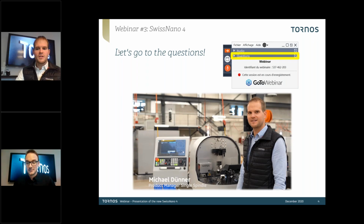Thank you. Last question again. How much time is needed to convert the machine to guide bushless machining? In less than 15 minutes, you can change from bushless mode to guide bush mode or the opposite. We have a parking position behind, where you can put your motorized guide bush, and you can leave it there without removing all the connections and so on.